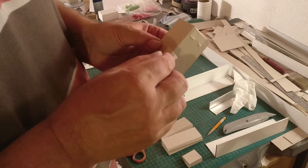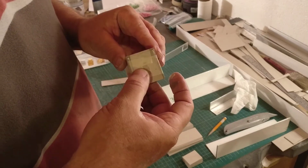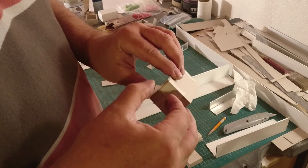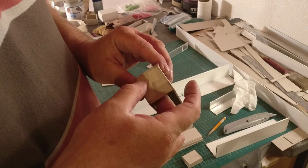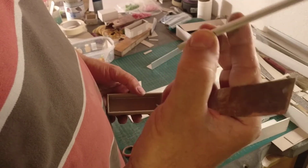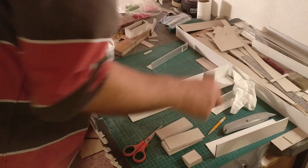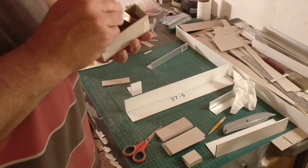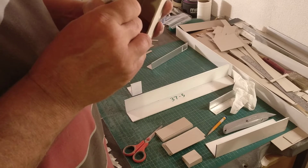You know, so if you're measuring one at 3.6 and one at 3.1, and you want them to be the same difference, you can be out a bit, and that causes that. So what I should have done, when I have my 3.5, instead of measuring 3.1, I should have used two of these at 4 mil and use that as a template, by putting the thing up there and then putting the two on the top like that, like I do for any other things, to bring it down by 4 mil instead of measuring a 4 mil difference.